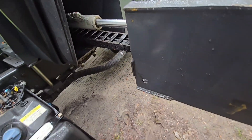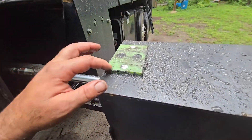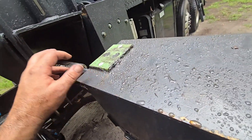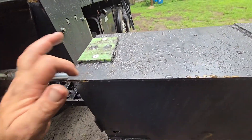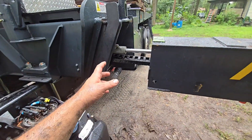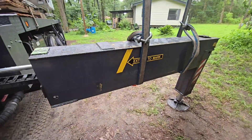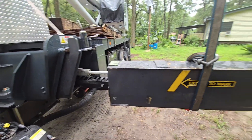There's enough room in there to where you don't have to on our model. That's not the same for every model, of course, so look out for that. This right here is another friction plate. This is supposed to wear out faster than the metal — keeps it structurally sound. And that's the right way to come about these leaky hydraulic cylinders inside of your outriggers.